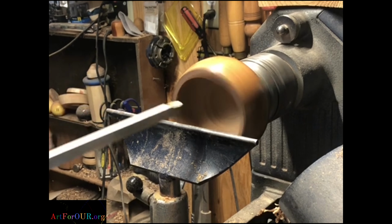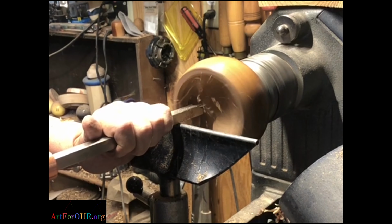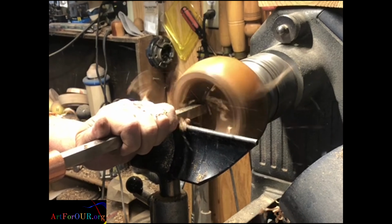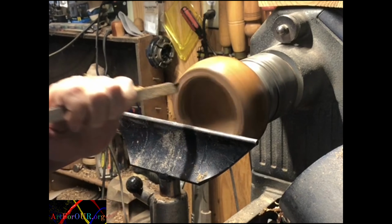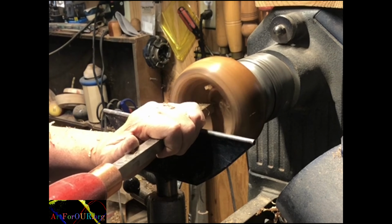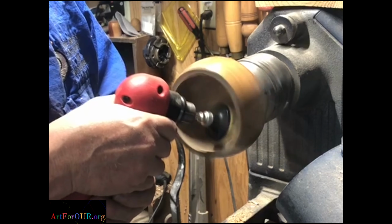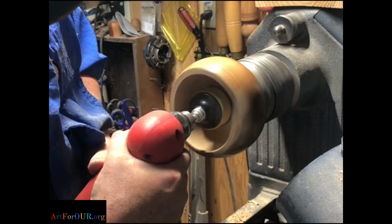That was the number one hollower. This is the Easy Wood finisher. This is the full-size finisher here. I've pretty well gotten done with the hollower. This tool has a little bit bigger cutter, and as a bigger cutter, I'm able to smooth the sides and the bottom a little easier and a little better than what that hollower does. The hollower removes wood very quickly, very effectively, very efficiently. And the finisher is able to smooth it quite a bit.